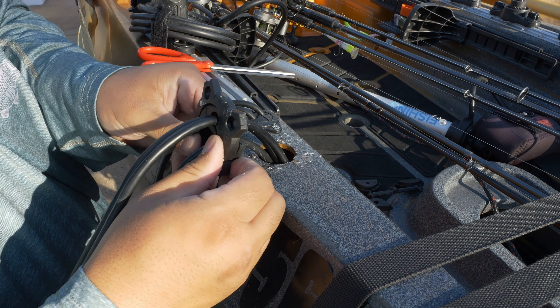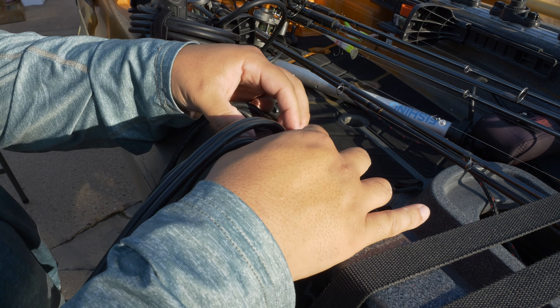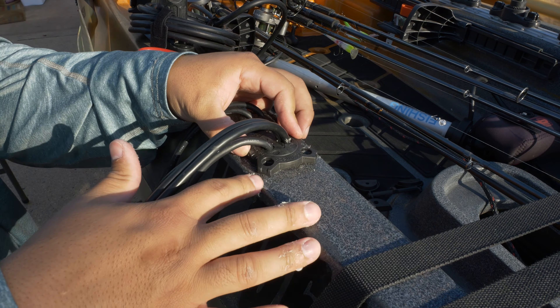We've got them all together. Now we're going to seat it down over those holes. One thing to note: those gaskets underneath that are sealing keep the through-hole a little elevated. That's why when you screw this down, I recommend — if you're just getting started doing this — definitely do it manually. There's a good possibility you can over-screw these and you don't want to do that. I've been doing this enough to feel it out, or you can get it started with the drill and then as you get closer to finishing, take the screw and do it by hand with a screwdriver.